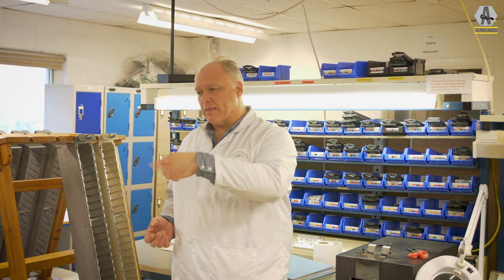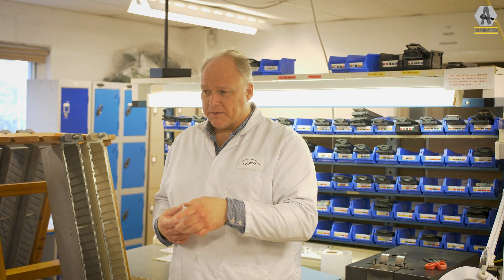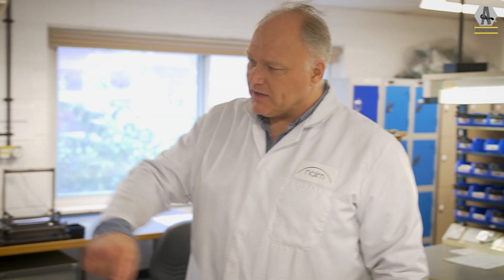You can actually see there's a turntable — not a record player, but a turntable with PCB boards on, and what we call a biscuit, so they're the same boards. This spins around and these mechanisms shine light through the board to see if there's an aperture or not, and if there is, it knows a component needs to go in place. It will punch the discrete component through the board, bend the leg, and snip the leg to a particular length on the underside. And believe it or not, that actually added massive consistency and sound quality control for us.